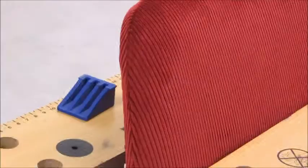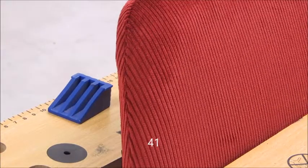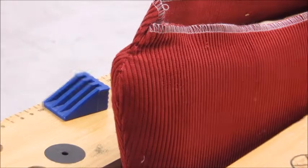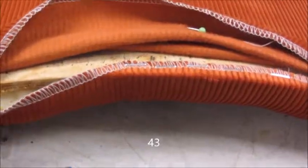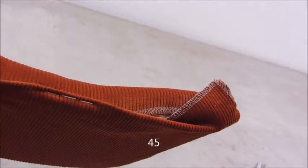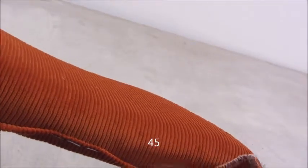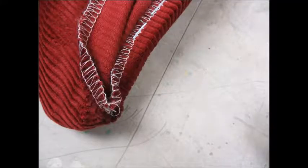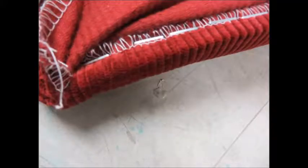Turn the cover. Make sure the corners are folded properly. Put the cover on the backrest. Put the backrest upside down into a mini worktop or something you have available. Staple the front at the back end, like this. Fasten the fabric from the back at the underside. Okay, once more, but then in slow motion, the corners as last.